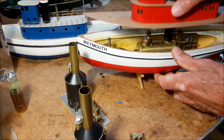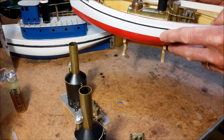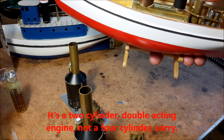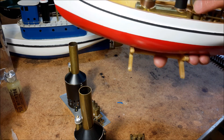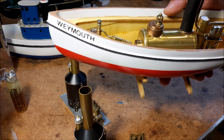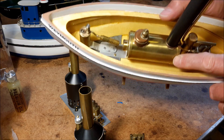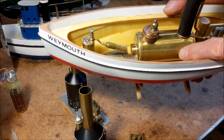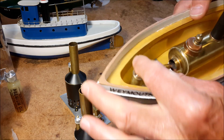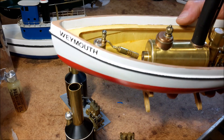It's the four-cylinder engine. Coming off the exhaust of the engine, I go through a little condenser and separator to separate out moisture, again to keep moisture out of the hull of the boat. This one has a little bit longer horizontal boiler with a large flue that goes through the center and then comes up the stack. And it has a little butane burner right here for a heat source. So that gets pretty hot and puts out quite a bit of steam.